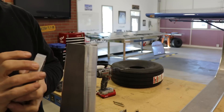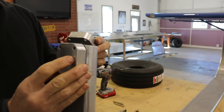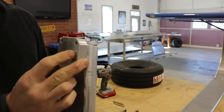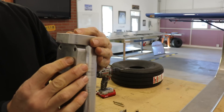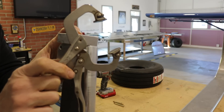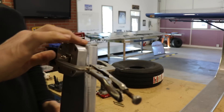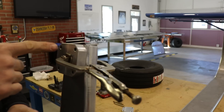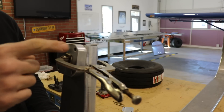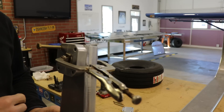There's really nothing too tricky about this. I'm doing this exactly like the Zenith manual says. They give you two spacers — I put one here and position the other one to make sure it's not crooked or off in either direction. This one is just used to align it. Once I have it aligned to where I want it, I'll use clamps to clamp it in place. After I drill the first hole, I put a bolt all the way through so it doesn't move. For each hole I drill, I insert a bolt — so by the time I'm drilling the fourth hole, I'll have three bolts and the clamp holding it in place.